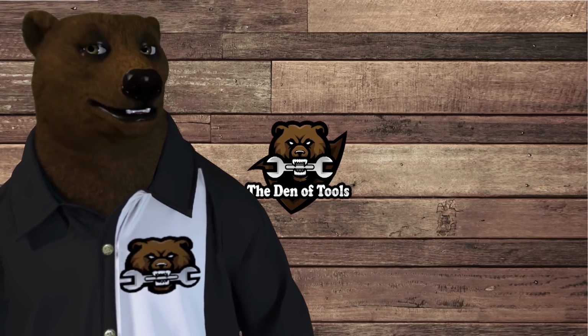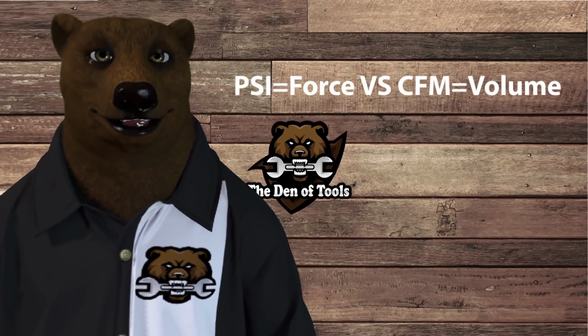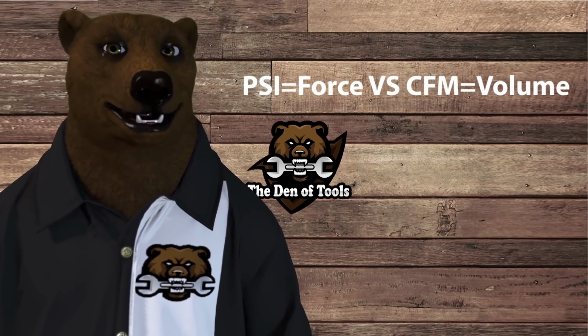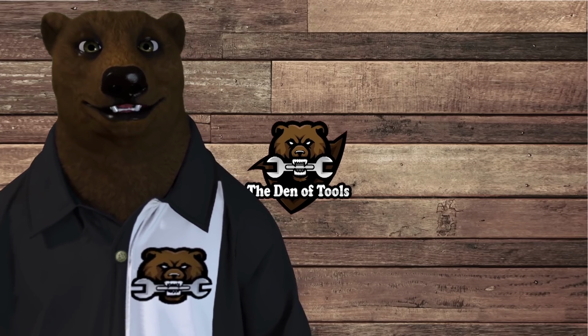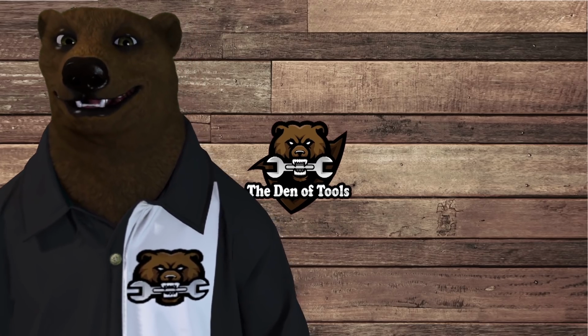Now, a good way to think about this is PSI is how hard something is pushing, and CFM is how much it's pushing. Like, if you can push one block really, really hard, but the other guy can push three of them just as hard, he's got more CFM at the same PSI as you do. All right, bearing that in mind, let's take a look at some of these tools.